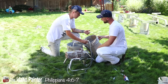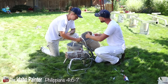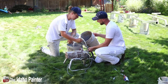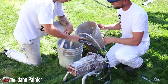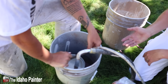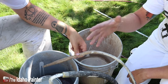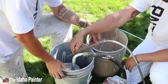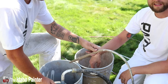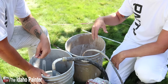Hold that bucket up and hold the hose so you can stick it back pretty quick, because you don't want to waste paint. Give it five to ten seconds and then you can move on. Just try not to get stuff on that wall. One of my pet peeves is when the prime hose just gets set into the paint. We will typically put that back in our discard bucket — that way it's not building up paint on the outside and it's just going to sit in that dirty water.